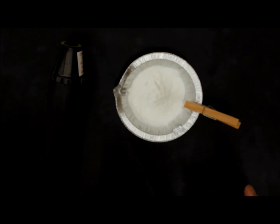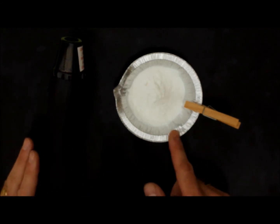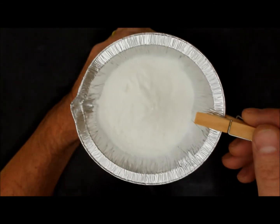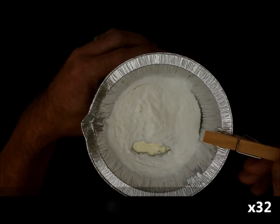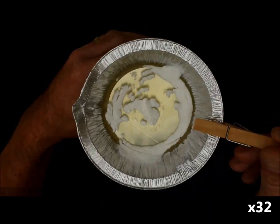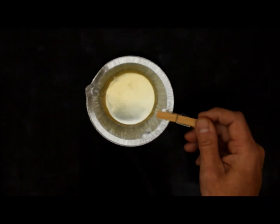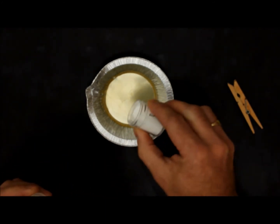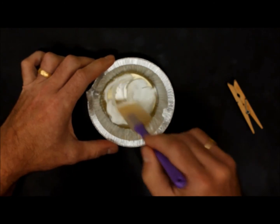So we will now start heating from beneath. Hold the heat gun vertically underneath the pan until it's molten. And that's more or less melted now at 7 minutes. So to colour, I'm just going to take some bright white superfine, sprinkle that on, give it a stir in,